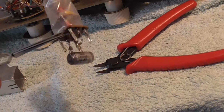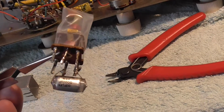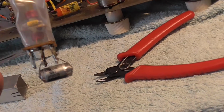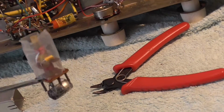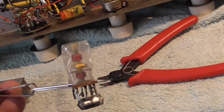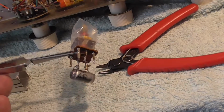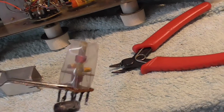I would test this. I don't know whether those capacitors are the sort that give trouble or not. I've always heard of the capacitors that are the mica plates, as it were, with the contacts on them, with the oily stuff that's supposed to protect them. The oil that goes on that type of capacitor is to keep the air out, to stop the capacitors from tarnishing too quickly. But of course, over the years of heat and use, they do just start to deteriorate, and that's when you get your mica disease. But I don't think you get mica disease with this type of capacitor.